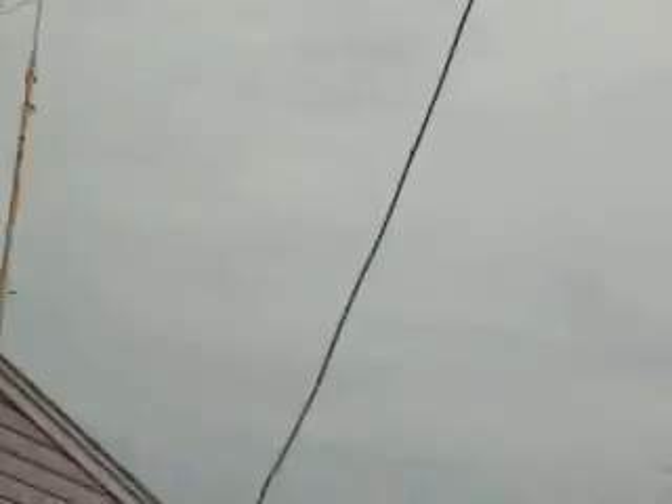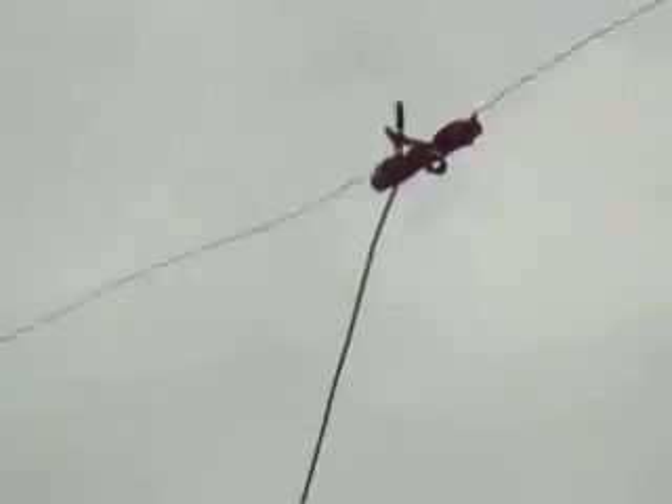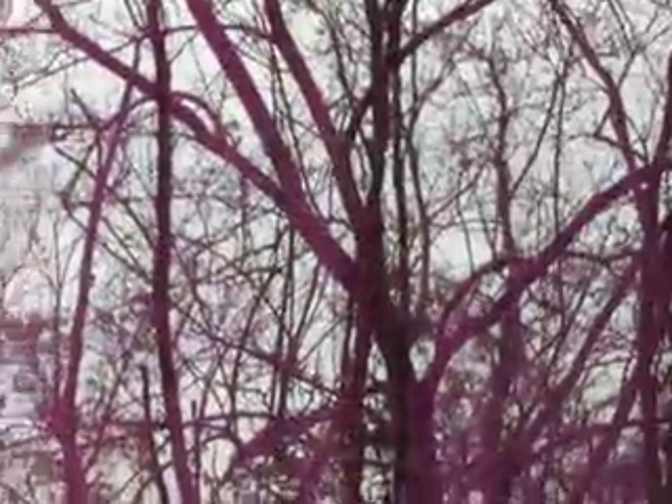I'm outside here, it's a bright day, and I'm not used to this camera. The antennas here do a very good job. On 40 and 75 meters I use those dipoles, and I use the vertical up there for 10 meters — it works well. The 2-meter antenna gives me quite a few repeaters around here on these mountains in Virginia. That Blue Ridge gives me the 075 repeater up on Afton Mountain, and I can get into West Virginia and different places. I probably have access to about 40 or 50 repeaters that I know of, and probably some that I don't know of.